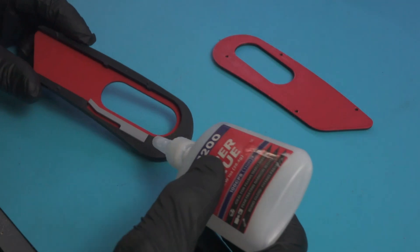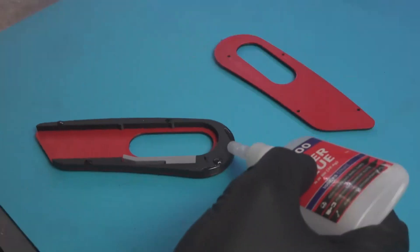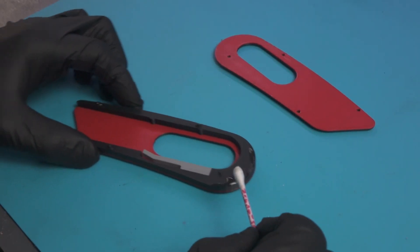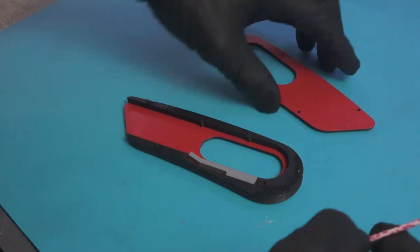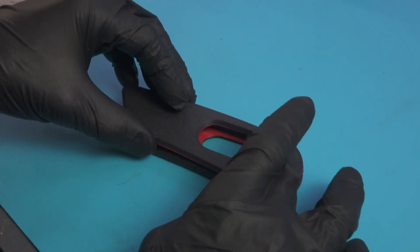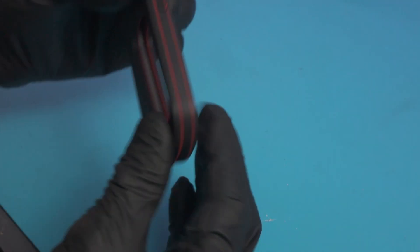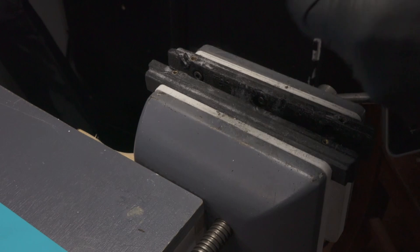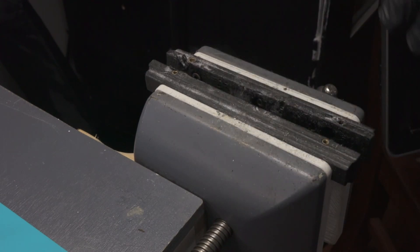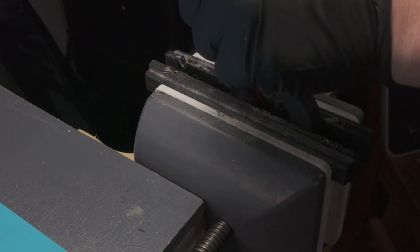After the locking arm is glued in place — and it's really important to ensure everything dries thoroughly — I proceed with gluing both halves of the knife body together. I try not to be too liberal with the super glue, just a few dabs and then the excess is cleaned up. Then I use a vise or a clamp to really help get both of those halves tight together. There are alignment pins that have been added so that when you apply the glue you don't have to mess around too much putting both halves together — they'll fit together really nicely.